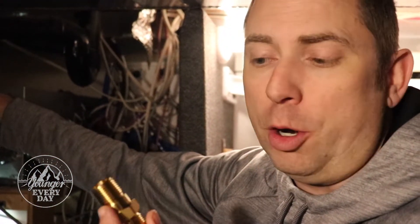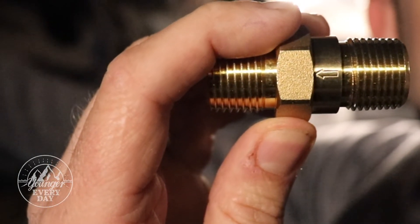The main thing you want to make sure of when you go to replace the check valve on your water heater: first, make sure your water is off and release the pressure before you pull the check valve off, just like I did. Once you go to put it on, make sure the flow is in the correct direction. In this case this is the outlet on our hot water heater, so I need the arrow pointed outward towards my fitting. One way to check is to look at the old one — I could see where it was threaded in and check the arrow, which was pointing out — so that's how I know which way it needs to go.